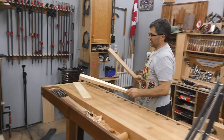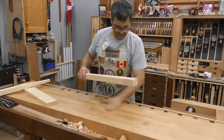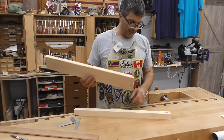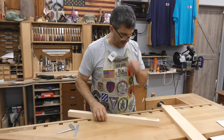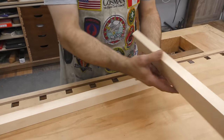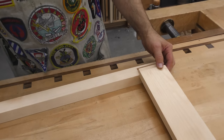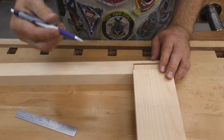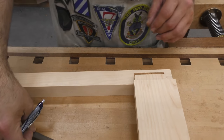We're going to work with this piece of pine, which is very easy to chisel, cut, and saw. It's great to learn techniques like this on before you introduce the extra effort required for hardwood. This is the apron we've cut; we already chopped the mortise — we did that in a previous video, and we'll leave the link below. I'm going to lay this out with a pen. On pine I would much prefer a pencil, but in order to be visible on camera we're going to use a pen.